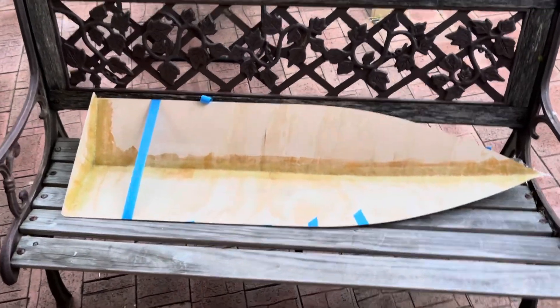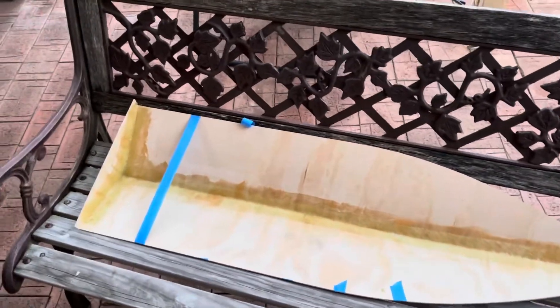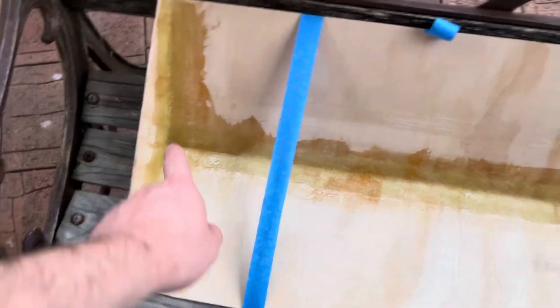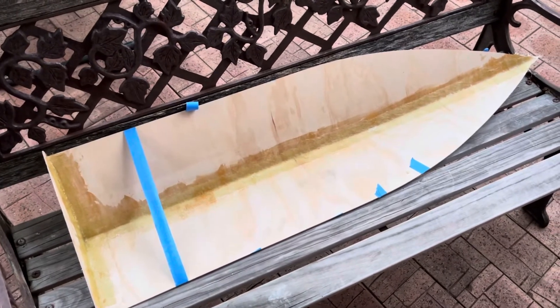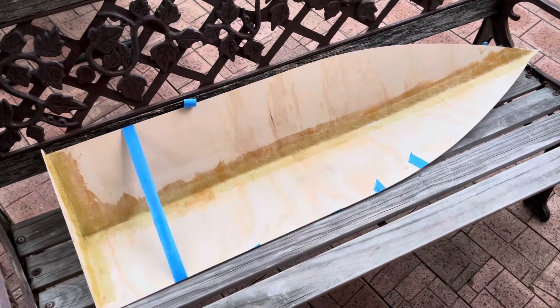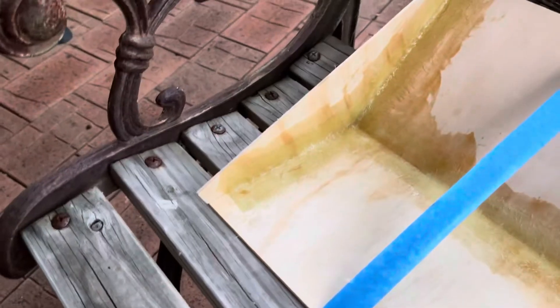We're getting to the end of daylight. That's just on the joins — this is chopped mat, it's not structural really, but it will give it much more strength than it's currently got, which is a tiny bead of PVA glue. As you can see it's all got this polyester resin going all the way through it, and I'll let that cure up. Then tomorrow I'll do the other side once that's nice and strong, and then focus on doing the sides. I've got enough wood for the sides for tomorrow. That is where we are at the moment — catch you guys soon, hope you enjoyed part one.